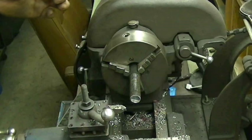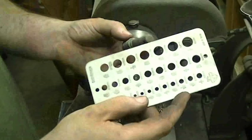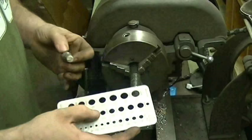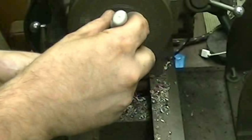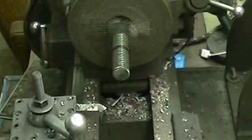What happens if you don't have those tools? This is the trick a toolmaker showed me a long time ago. This is a drill index — this one goes all the way up to a half inch, which is perfect for exactly what I need. This shaft will fit through the half-inch hole, so I'm going to machine this down and keep checking it with the drill index, and once it slides through the way it's supposed to I know I'm at my mark. It's not precise, but it's going to get me in the ballpark I need to reinstall this inside the housing. I'm going to take a black Sharpie, take my original piece, and mark roughly where I need to stop my cut — I am a good two inches away from the chuck.